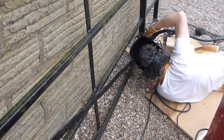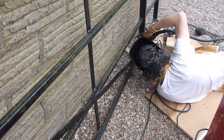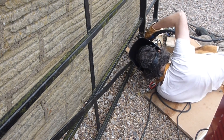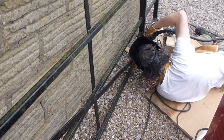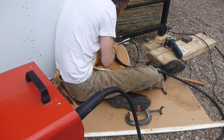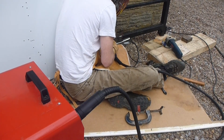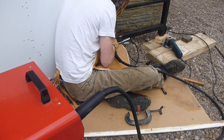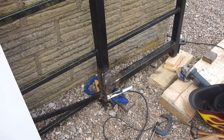I'm taking very short little tacks because the metal I'm welding - the patches - are only two millimetres thick, so that's relatively thin. I'm trying to weld onto some bits of the parent metal behind it, which is quite heavy section box, although it was completely rotted out. As I was welding I just kept burning through, so to stop that I'm just doing lots of little spot welds - put a bit of weld on, let it cool down, then put another bit on. That just stops you burning through.